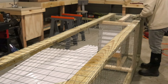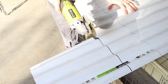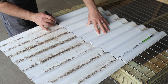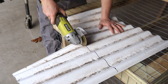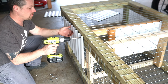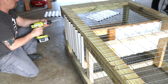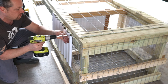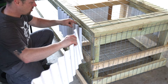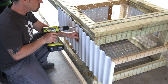This is when we turn the tractor on its side and start stapling the bottom of the frame — we'll do both sides. Next we'll cut our siding pieces at 15 inches and make our way all the way around the enclosure. We'll simply overlap, draw a line, and use our angle grinder to cut. I put the pieces up, overlap the next piece, back the screws out, and then slide the next piece behind it — just a little maneuver that keeps everything straight.